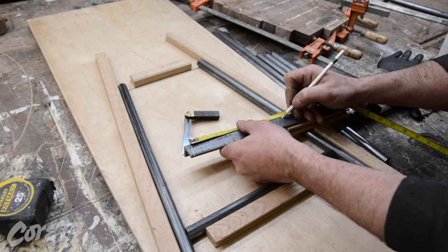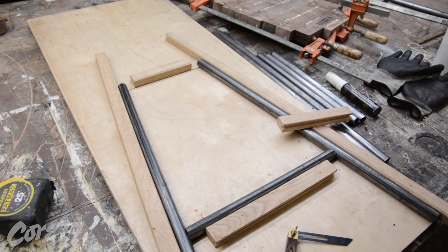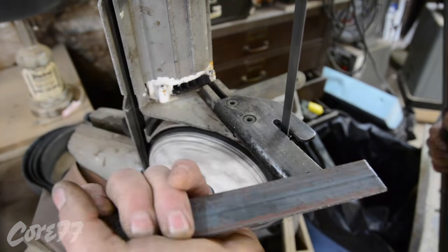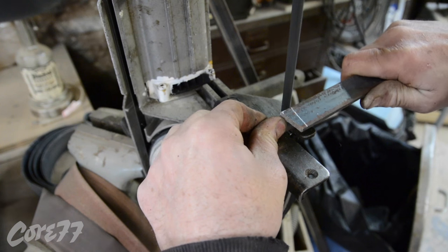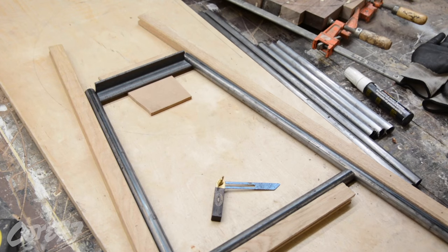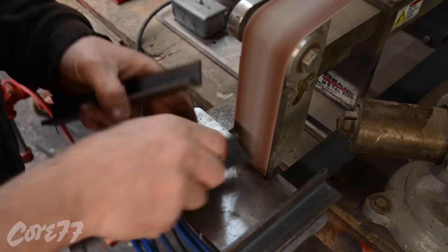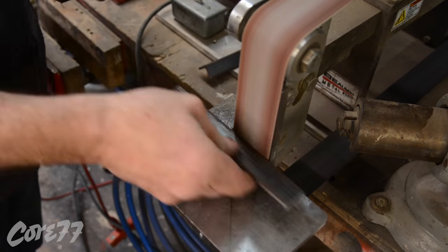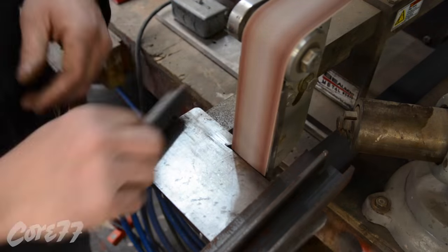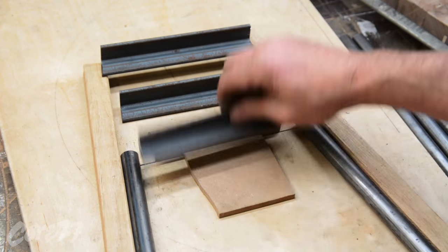Now I need to cut the top. It's angle iron — I'm using one-inch angle iron. One side of the angle is going to be welded to the sides of the legs, and the other side is going to be the flange by which I put a screw through. So I'm making sure I get one correct and then I duplicate it four times. And here it is — fits good. Now I need to make four more. So I've already cut them and now I'm just adjusting them and sanding them a little bit, making some room for the weld. Then I check them — each one fits.